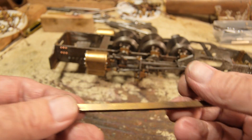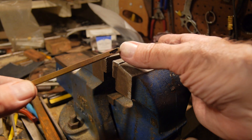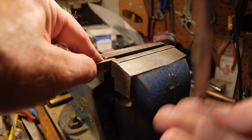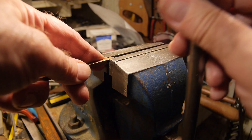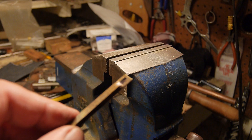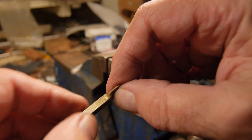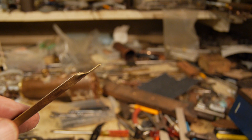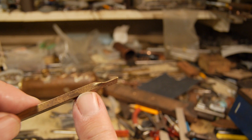I do that in a very simple way — I just take a hammer or a vice and squeeze the end of the tube until it's flat. I've annealed the end of the brass by heating it up until it's cherry red and then cooling it in water. I then put it in the vice about 3/8ths of an inch and squeeze it until I get a flat, just like that. I've actually flattened it a little bit more so it's level with the bottom edge, just for the positioning on the pin and slot in the front buffer beam.